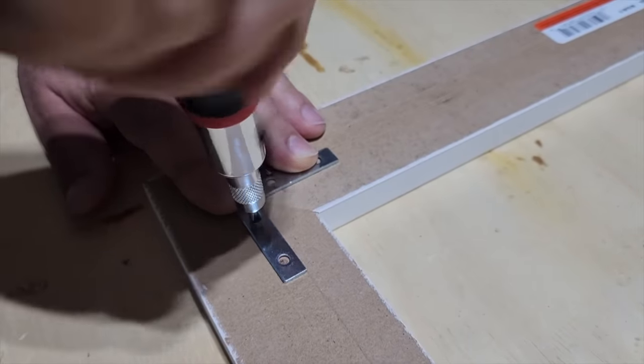Again, we're going to go with the glue — put it all the way around the box frame we just built because we're going to lay the frame on top. If you measured right and took your time, it's going to fit just right. The last thing is to use the brad nailer again and put just a few brad nails to hold it together. Once you get those in, let's cover up the nail holes with a little bit of spackle, let that dry, and sand it clean.